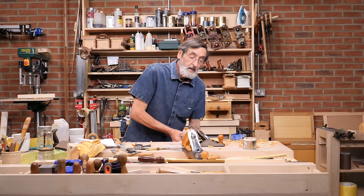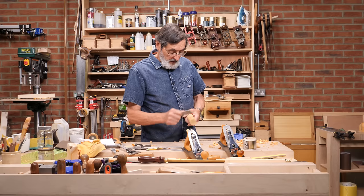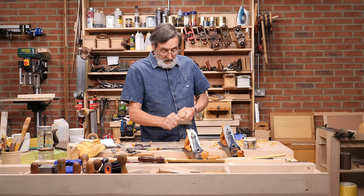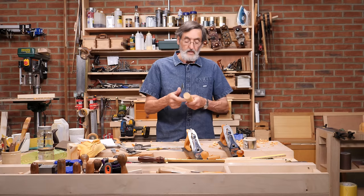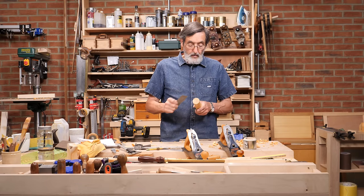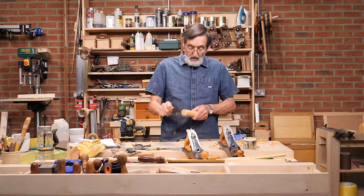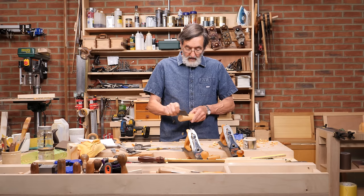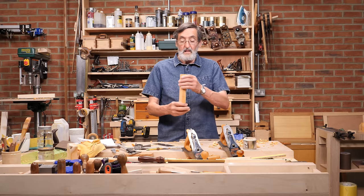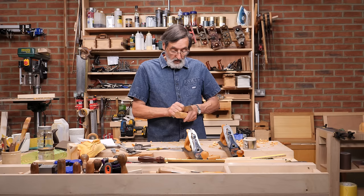So now we've got a decent round shape, which is what we wanted for the handle. And you can refine it as much as you want, but all I wanted was this outside reference face, because it's all going to completely change and there will only be the very top of the arc that I've just created that will remain in this, because everything gets rounded yet more at 90 degrees to this long axis. So there it is, simple method for getting this into a long thick dowel.